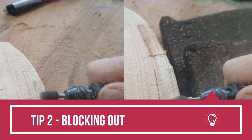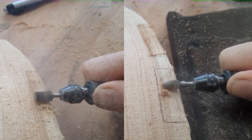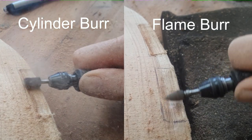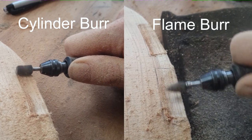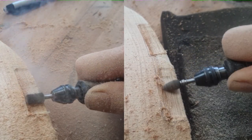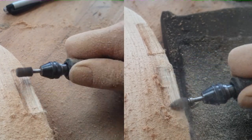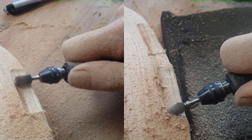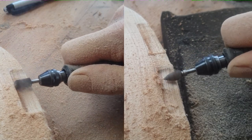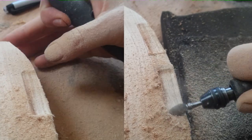When it comes to blocking out, I think they're pretty much equal. I guess the Flame would get into tighter areas, but where the Cylinder Burr really pays off is taking down flat planes — you can see it here. I'm just going back and forwards with the Cylinder Burr, whereas with the Flame Burr I've got to alter the angles to keep the flatness of the wood. I'll go down with the flame and then change the angle just to keep that flatness, but with the cylinder I just keep going back and forwards.